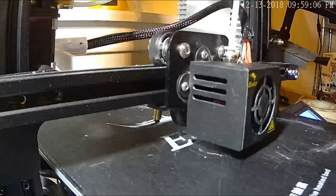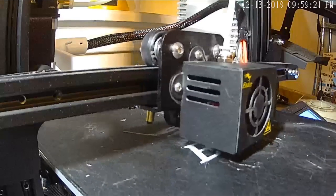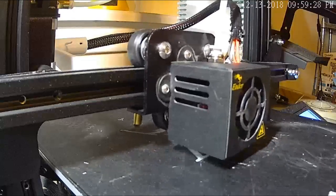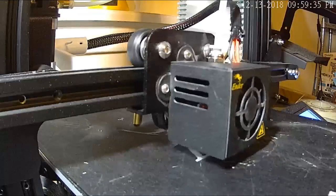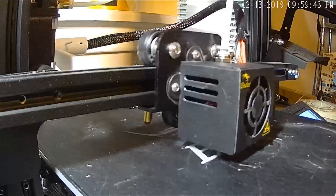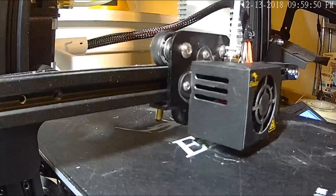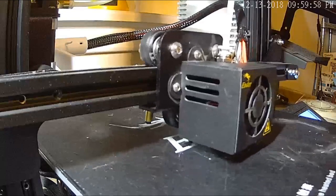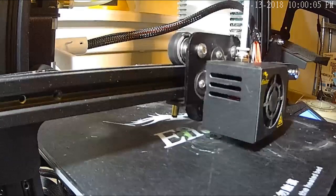I'm gonna look at the slicer settings, maybe, and see if this one didn't have the fan running in the front. I thought the front fan was based on the temperature, and I would expect it to be running, but maybe it's the filament cooling fan or something. I don't know. I know Ken had said that there's a print cooling fan, and that's G-code controlled. I know in the CTC, to get a print cooling fan, there's an extra fan to actually add to the front. And I didn't have that on that one.